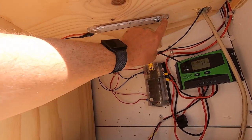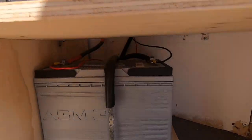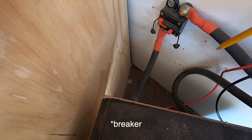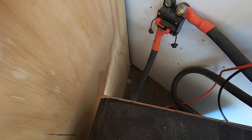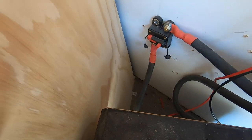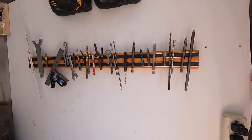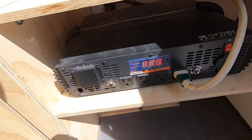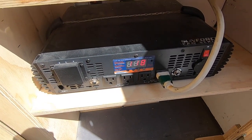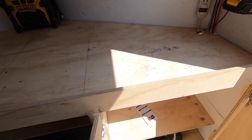I've got a little light in here and then I've got big wires with a 300 amp fuse and heavy wire hooking up my inverter, so I don't have to worry about voltage drop or anything getting warm. I can turn this on — it comes with a remote switch but I don't really need it. Everything's pretty compact and I can just close this up to keep the dust out, but I try to leave it open if it gets hot so it can breathe.